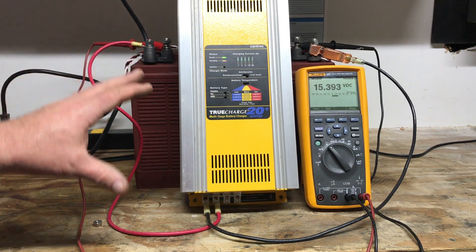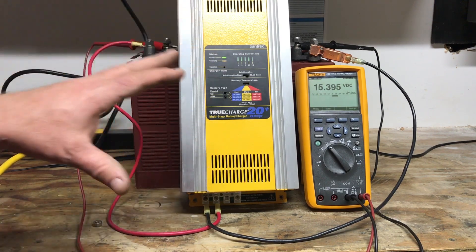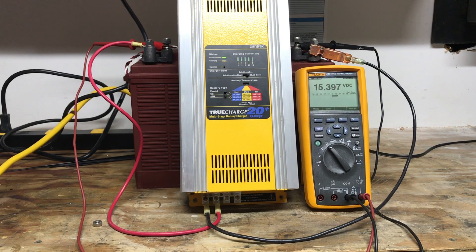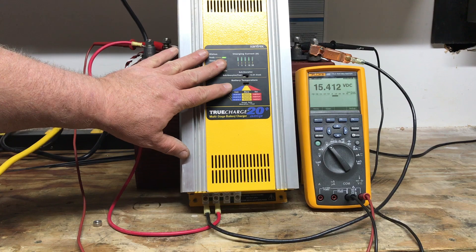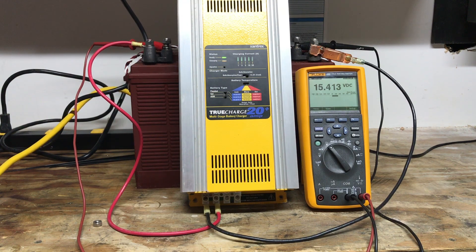This is one of the most concerning failure modes I see with battery chargers. For this customer, he was very lucky that he only had a 20 amp charger on a 400-plus amp-hour bank. If he had been using an inverter/charger, which a lot of my customers choose to do, that could be throwing anywhere from 80 to 150 amps into a dead short in a battery. This is one of the reasons why boatyards do not generally allow boats to be stored on the hard while charging — because these sorts of failures can and do happen. This charger has lost its voltage regulation circuit and there's nothing that can be done about that. When it's gone, it's just going to start overcharging the batteries, as this one has.